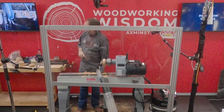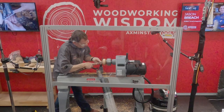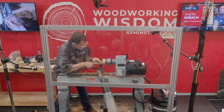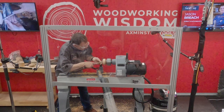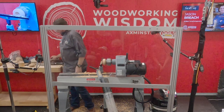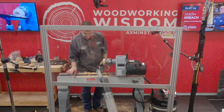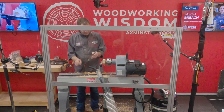Already thinking about the curve shape inside. The flute is going to go from nine and a half, rolling it right over to two o'clock on the inside. I want to get a cut and come around. Fingertips will tell me what's happening in here. We're going to clean it up and refine it. We've got our curve and we need to create a little flat. It's a round nose scraper — I have an unusual scraper with a hollow grind on the top. Negative rake grind — this fans out from the centre. It's factory done.